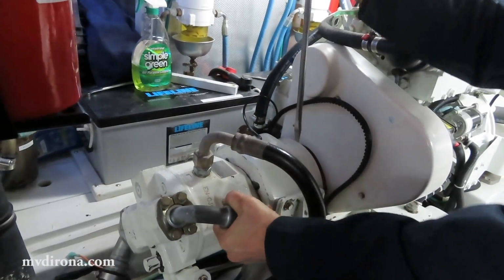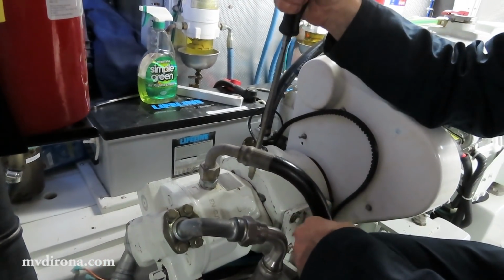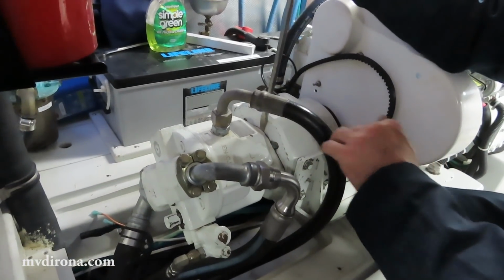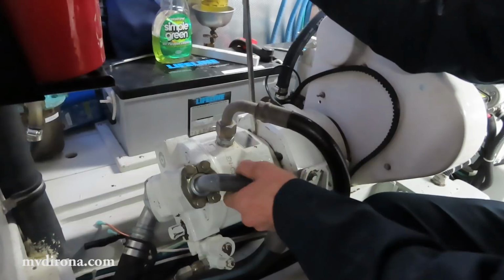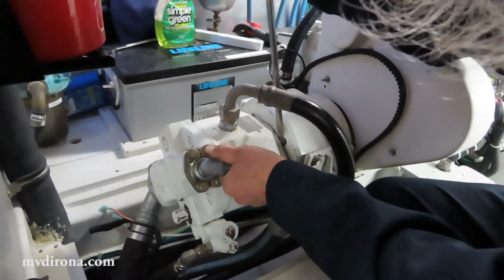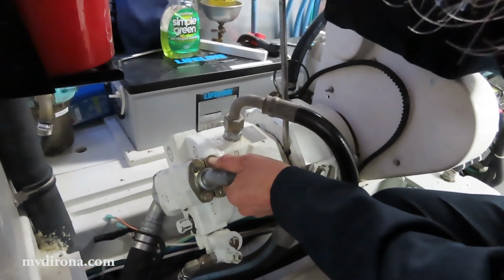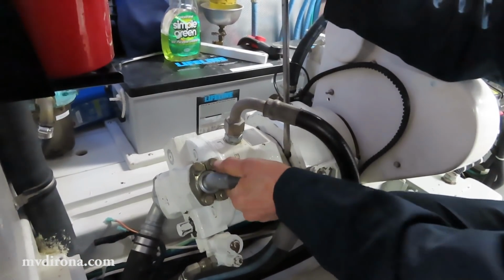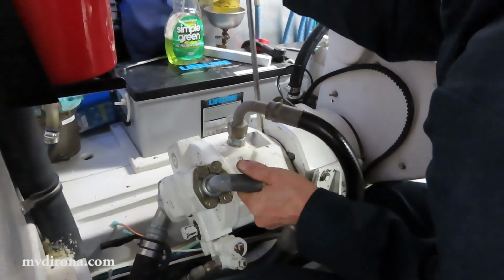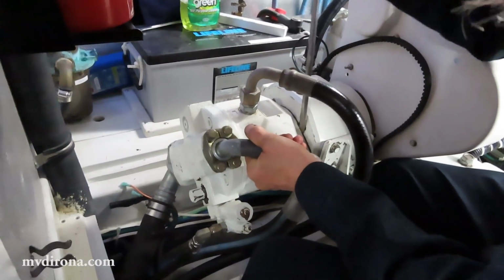I'm using a pry bar right now just because I have been unable to shift it free, and with the pry bar, you've got to be very careful. There can be no nicks, nothing on that surface, and so it's really not something you should use, but it's so tight I'm unable to get it otherwise. There's this little gap in here that I've been using to lean on, and it is coming free. It is a 1/8" gap opened up now, and so we're progressing.